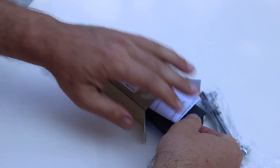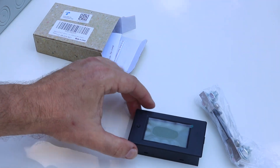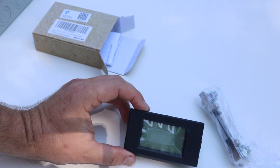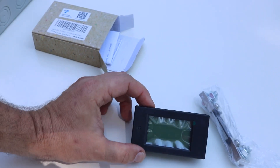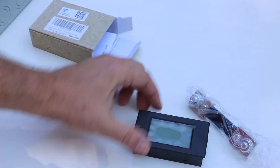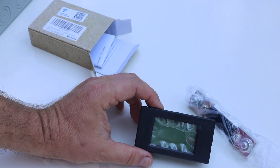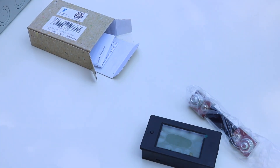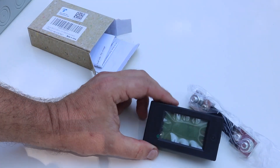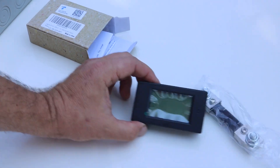You may also want some other type of instrumentation. I've already got a lot of info on the solar charge controller, so that'll take care of info about power from the solar panels. But I thought I'd use a little DC multimeter display with a DC current shunt that'll give us information about how much power and energy is coming from the battery — the same panel I've used in my garage with my solar system and for tracking energy from my electric car.